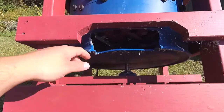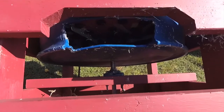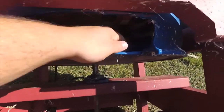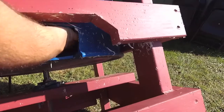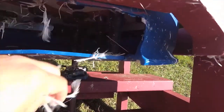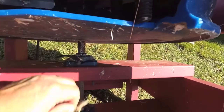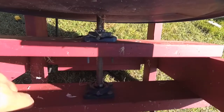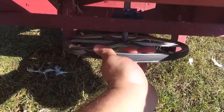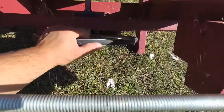Another design in the book calls for you to cut the whole bottom of the barrel off, but if you leave the bottom on and just cut out an opening like this, and point a couple of the fingers downward, they actually help shed the feathers so water doesn't drop down on the pulleys and bearings, and doesn't wet the belt so you get better contact. Here's another view of the pulley — it's not spinning well right now because the motor is up against the ground, but that's basically how it works.